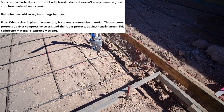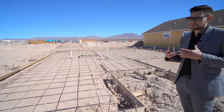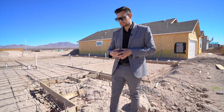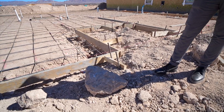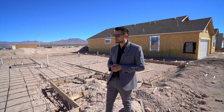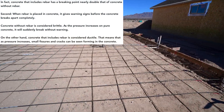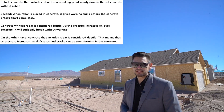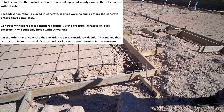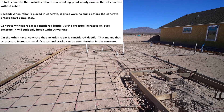What I like about this builder is that even though the soil here in Metro Verde is a lot more solid — for example, these here aren't rocks, they're clumps of dirt; the soil is very hard — they still use rebar. This foundation is pretty much ready for the pour. They already did the footings, the lot frame, and the plumbing.